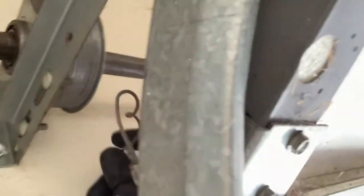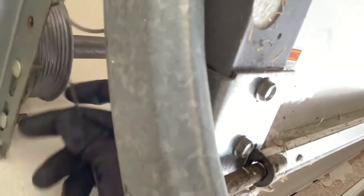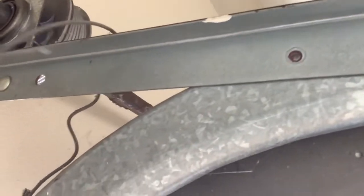If you start to pull down and one side gets hung up, you're in a bad way. So here's my tip: take this cable and go over the horizontal track. The cable comes from the door and goes directly above the horizontal track so it stays free and clear the whole travel as the door moves — going up and above and over and around.